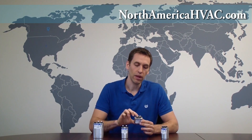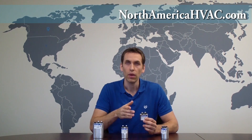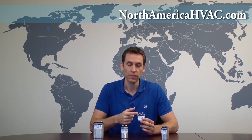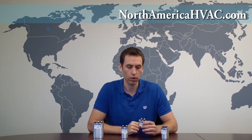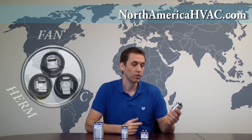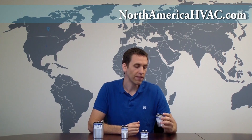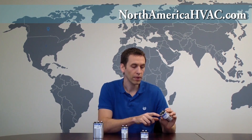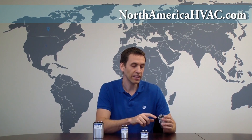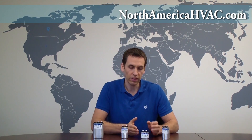When replacing these capacitors, if you have a single capacitor and you pull the wires off and don't know where they went, it's not a big deal because they're reversible. If you have two wires, one on each terminal, and you switched them, it wouldn't make any difference to the motor — it would run just fine. But with a dual capacitor, you typically have stamped right next to each terminal set a name such as Herm, Fan, and C. Those are universal labels, and it is important to get the wires on the right one. Fan powers the fan motor, Herm is for the hermetic compressor, and C is like the adjoining wall between the warehouses that works with both the fan motor and the compressor. So on a dual, get the right wires on the right terminals, while the single is reversible.